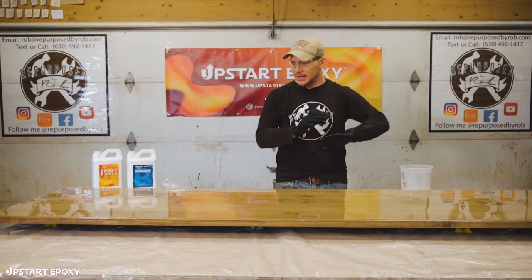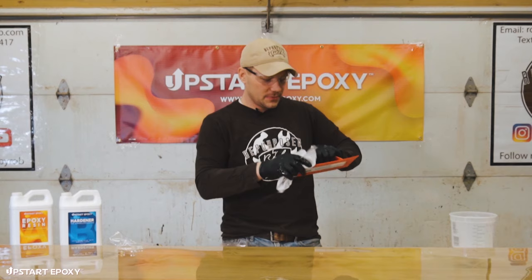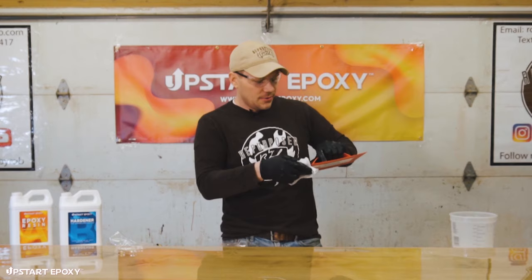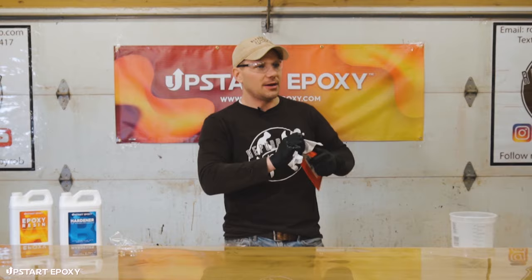It's not going to be perfectly level with the seal coat — that's why we do a second coat on top. I'll wipe off the V-notch trowel so when I do the final flood coat I can use it again without cured epoxy in the notches. Use a clean terry cloth or t-shirt rag — not a paper towel, as that'll leave residual paper marks on your tools.